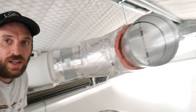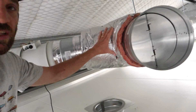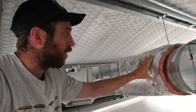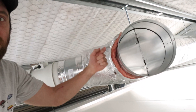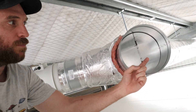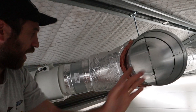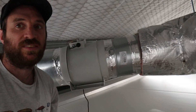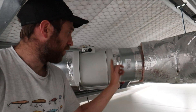You can see the ventilation pipe obviously comes straight down there, all the way down to where it comes to this Y joiner here. This Y joiner has two — I think they're called backdraft dampers on the end here. You can see in there — so this allows the air to move through it this way, but prevents it going back the other way. On this side here, the other part piece to the Y: one goes that way, one goes that way.